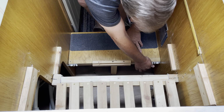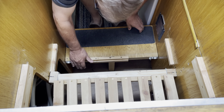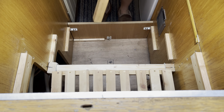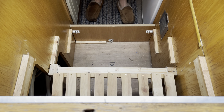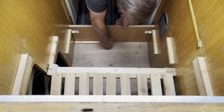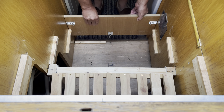The next step just has 2 little bolts, one at either side, and that then lifts up, and then there's a supporting bracket which just comes out, and then the bottom one here, that just has 3 little bolts that come out, and that then just slides out.